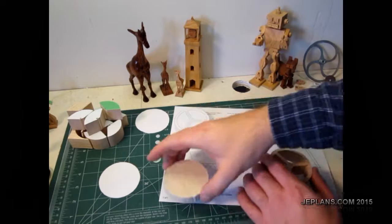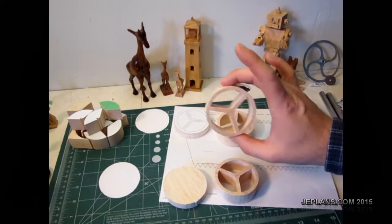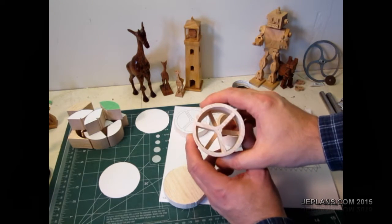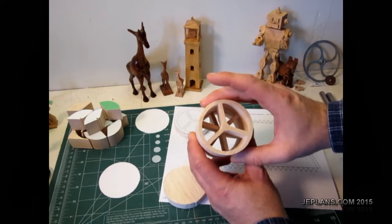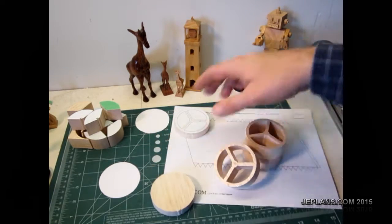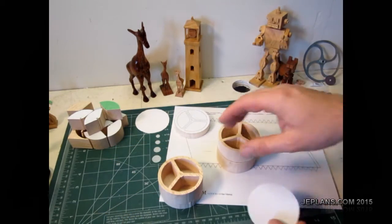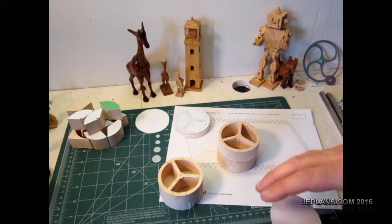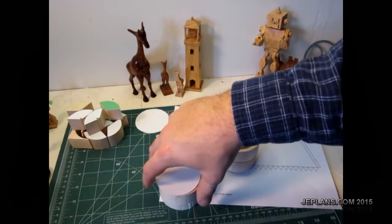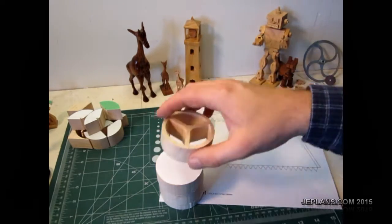I'm continuing to make my balsa displacer to replace the popcorn one. I've cut out several thick pieces of balsa and cut out some chambers to reduce their weight. They'll stack up — I'll alternate the layers to give them a little more strength. The bottoms will be solid pieces. This makes the displacer airtight and structurally sound so we can get maybe a little more force out of the engine. I'm going to separate and break up the interior chambers with just some cotton paper — just kind of stack it up and glue it all together.